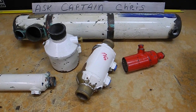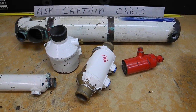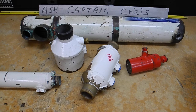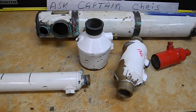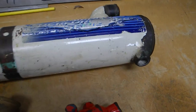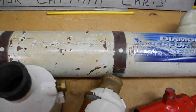In a different video we talked about your engine overheating. It could be because the rubber raw water impeller is destroyed, not pumping enough water, or it could be because your heat exchanger — think of a heat exchanger as a water-cooled radiator. This is a large one that came off of a Cummins Diamond Series diesel engine.